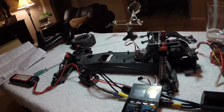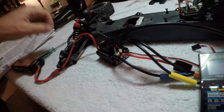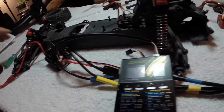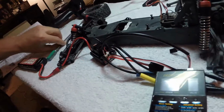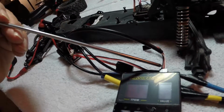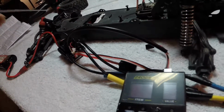Okay, next steps. They recommend you get this program card, and on this program card you unhook or disconnect this wire set here, and you connect into this portion into the same plug, and then you come back into the back here. They give you a wiring diagram, and they also point out in there, just to make sure you get your timing right, that the black is ground, and they give you a minus, a plus, and an infinity sign for the white. So when you're looking on this side, you'll see the same notations.